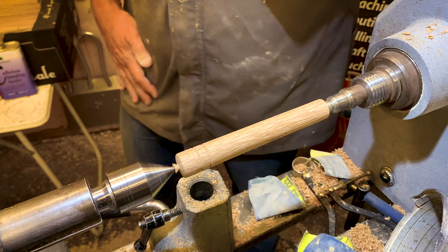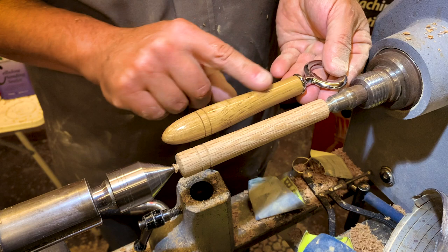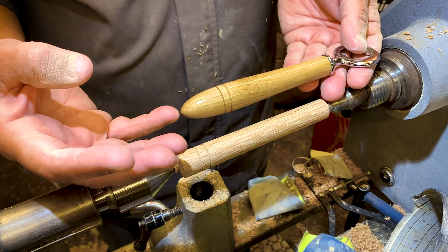So our choices now, if we look at the one that I've already done, you can see the shine. This was a coat of sanding sealer to raise the grain, which I then sanded off. I then used a Chestnut acrylic spray lacquer, in this case a gloss version, and that's created a really hard finish. And if you like gloss finishes, perfect. I want to give myself the option of something which is matte or even satin.